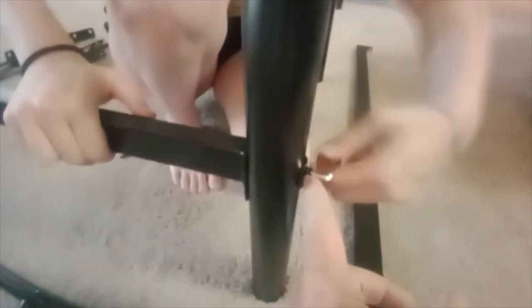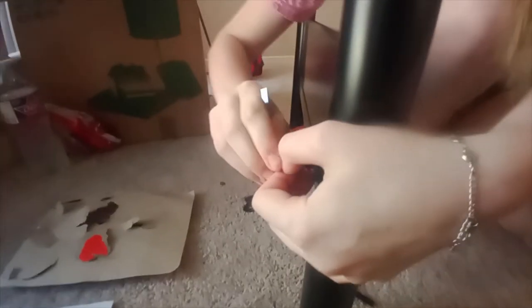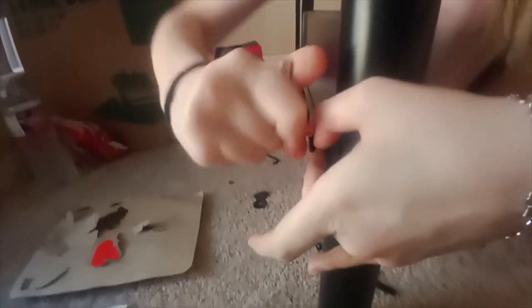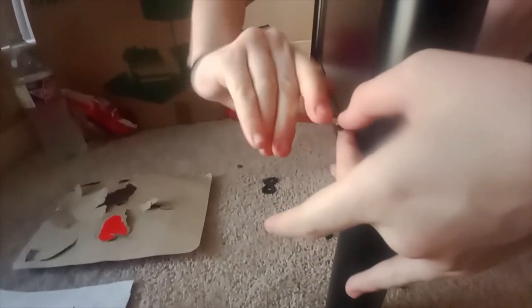Make sure that's lined up. There's a lock washer and a curved washer that goes here. Tighten this — but I should say before we start, don't tighten all these bolts tight. Just get them started, because if you get them too tight the other ones won't go in. Make sure you get all of them in loosely first, then go back and tighten them all up.